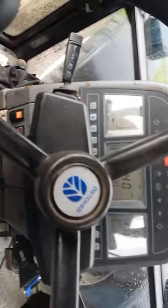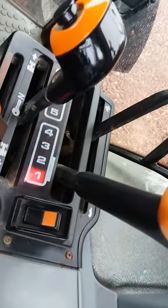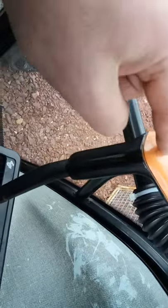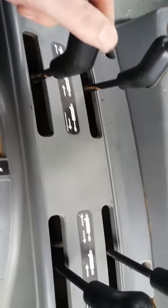Okay, this is the cab. You have your gears here, your hand throttle. You have one, two, three, four — press the button and you can go up to five, six, seven, eight. You have your forward/reverse. This lever is one, two, three, four — forward/reverse. This here is your crawler gear. As far as I know, the difference between the SL and the SLE is this crawler gearbox. You also have your beacon, back wipers, depth control for ploughing, emergency shut-off, and PTO.